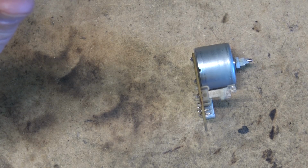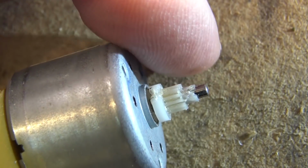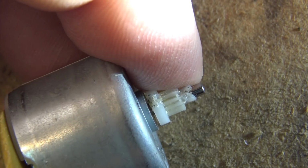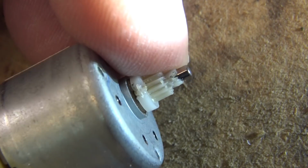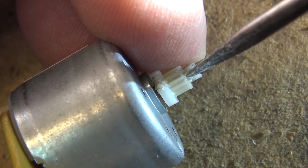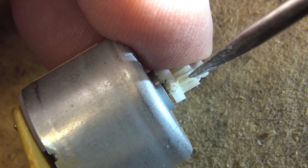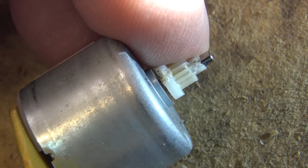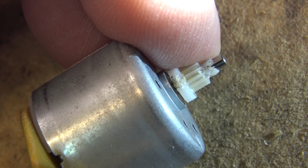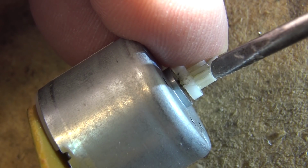There was a good sized space that you could see before, and now there's not. So right here where I fused these teeth together, that's where the crack was. It was right here, where I'm pointing. It was right down here. There was a space between these teeth, and that space has now been closed up by fusing the plastic both above it, or the crack, and down below it and right into here.